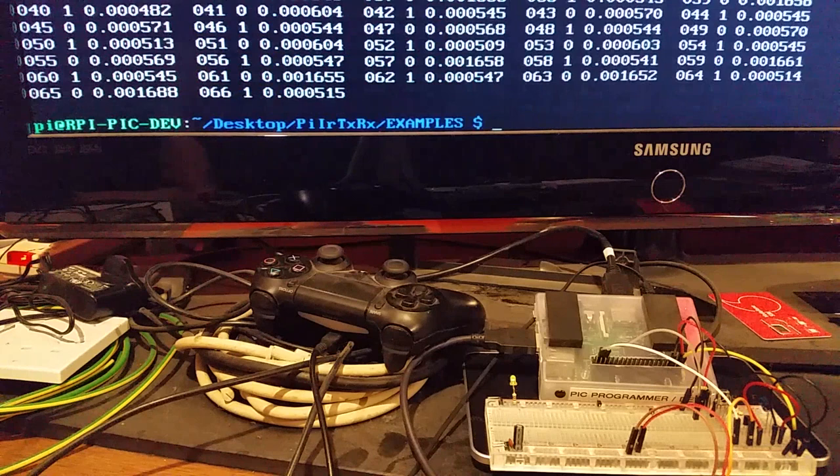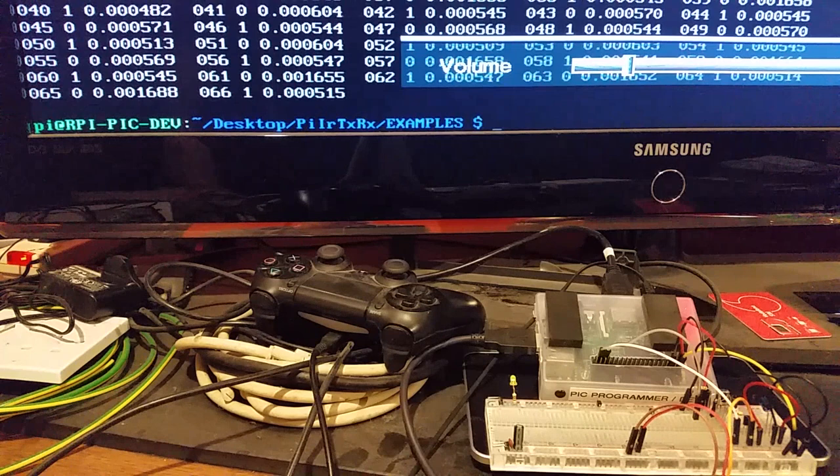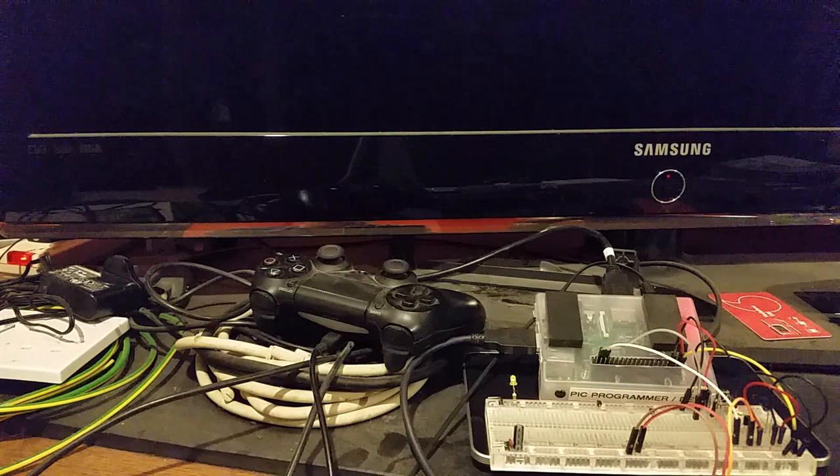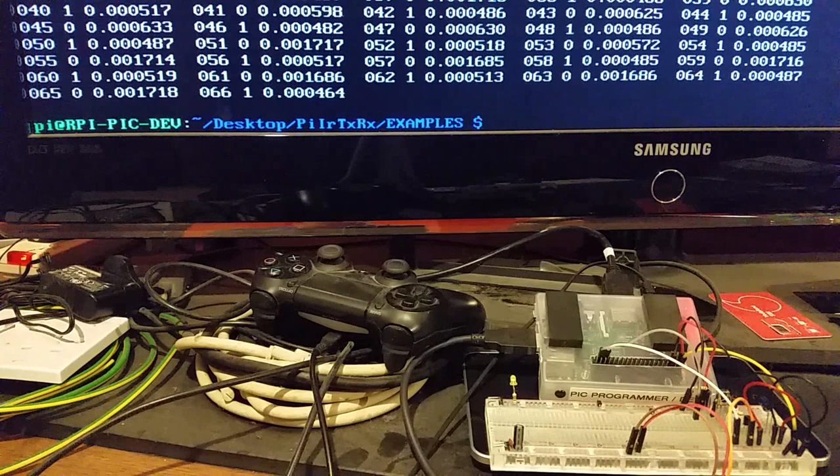In the examples directory I've got a few of the controls ready. If I run the volume up control you can see the volume go up on the TV, then there's the volume down control. I can also power the TV off and hitting up and enter again brings the TV back on — it takes a few seconds to power back on, but the display comes back. These are just some examples, but you can record any of the commands and play them back. Some controls may not be on 38 kilohertz so some TVs may not work, but I've used it on my Humax satellite receiver and my Samsung TV, as well as a different TV which isn't a Samsung.